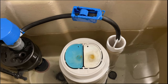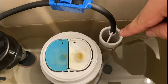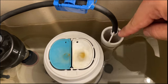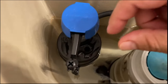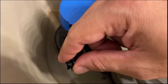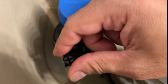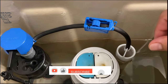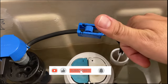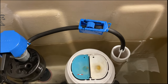As a final note, it is recommended that the water level stands at half an inch from the top section of the overflow pipe. If you need to adjust the water level you can do it easily by turning this knob clockwise to increase the water level or counterclockwise to decrease it. If you found this video useful please give it a thumbs up, subscribe to Handy and Easy, and as always have an excellent day!